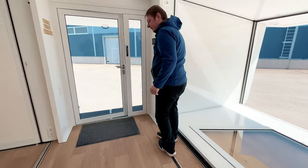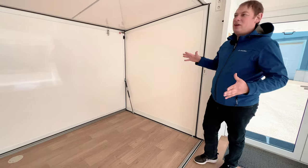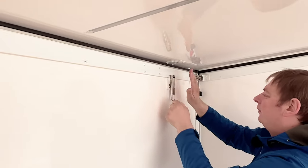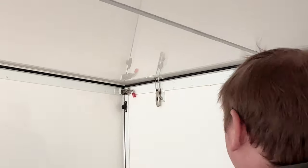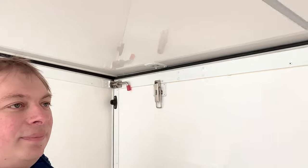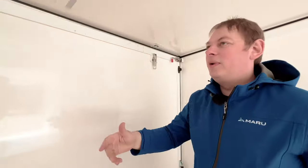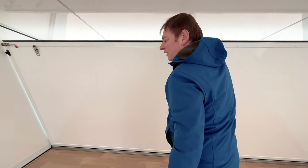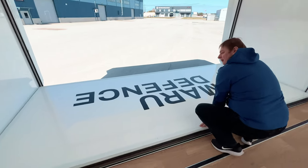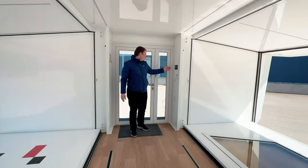Give it a gentle tap because it has rubber sockets that need to slide into each other. Same on the other side. Pull again in the center — this side is much easier because it's a very lightweight wall without windows. Now that this is done, go to the hydraulics panel — or you can use the app, depending on what you prefer.